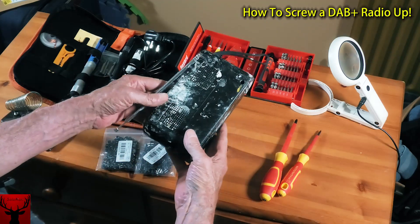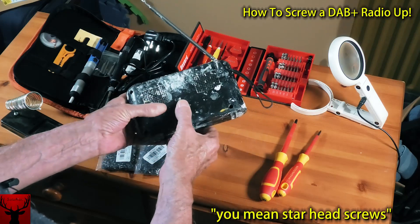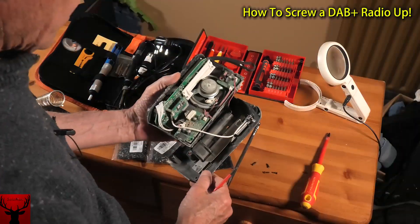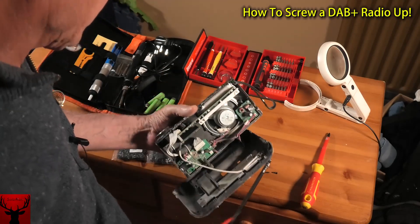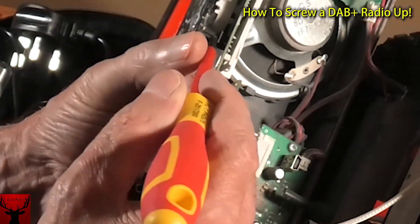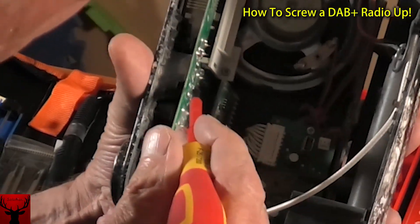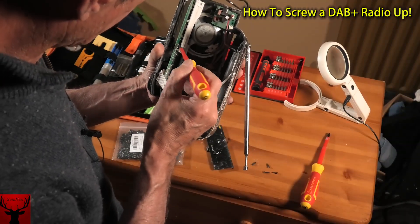Alright, so I'm going to take the back off. To do that you undo four screws, and I'll take the batteries out first of course. I'll just show you when I've got the screws out. Okay, so I've got the screws out and the back just flips off. What we're interested in is this button right here — there's the micro switch if you can see it, it's a little plunger that goes on top of it. And it looks like it's a four-pin. I've never actually been inside this radio before, so I'm going to take this off, get to it, and have a closer look.